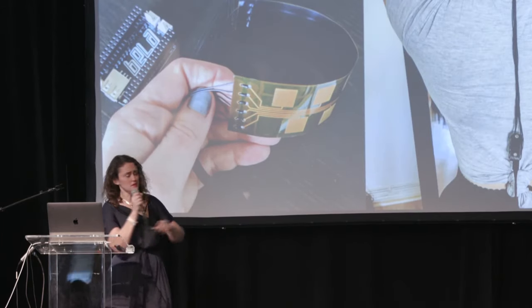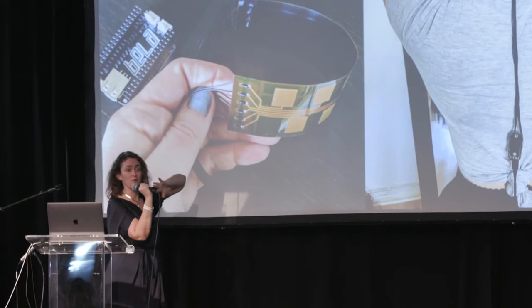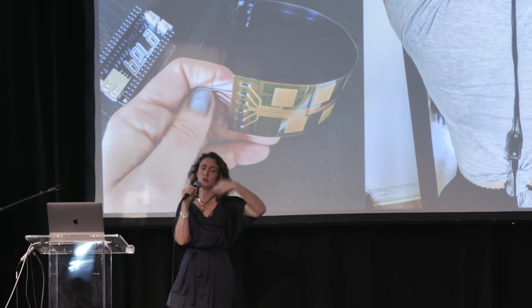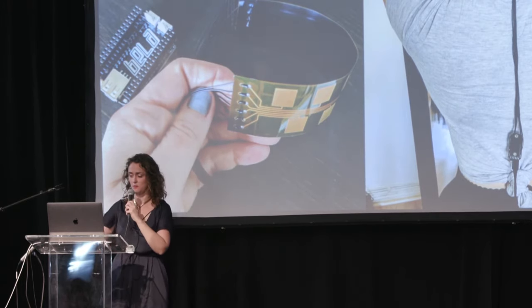This is another project — a flexible PCB. It's the second PCB I've ever designed. This is going to be a vocoder, so I can play it by touching my throat. It uses, as do the creatures, this cap touch board — a Trill sensor. Capacitive touch is really annoying to work with on the body because it can't tell the difference between the skin underneath and your finger on top, unless you've got very sensitive sensors. The Trill sensor — they sent me a prototype and I'm completely in love. It's like an MPR121 except it's got a different chip with 30 pins and it's way more sensitive. So I'm actually able to make working wearable cap touch instruments, which is kind of cool. It plugs into this — a cape for a BeagleBone. Underneath is a Pocket Beagle, so it's this big. This is now my weapon of choice for making embedded instruments. It's super fast, super small, and the killer app for me is that you can use established music technology — specifically a program called Pure Data, an open source piece of software that is visual block-based coding allowing you to create very complicated sound synthesis. You can save your Pure Data patch onto the Beagle and it will autoplay, which is an absolute game-changer in terms of the complexity of embedded instruments.